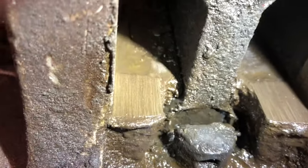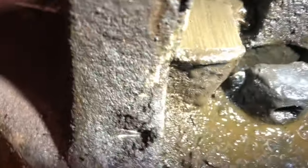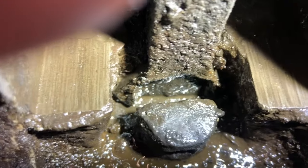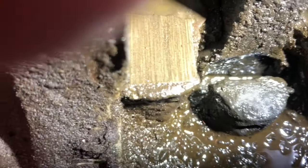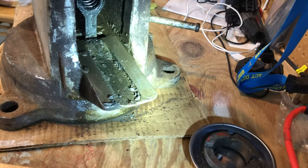The interesting thing is, this vise has some slop when you open and shut it, and I think that's exactly because that mechanism is what's being used. So that amount of space right there, I don't know what that is, less than a quarter of an inch, allows that nut to slide back and forth before you get positive engagement. A lot of gunk and oil in there.